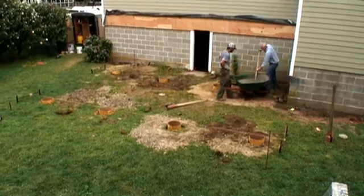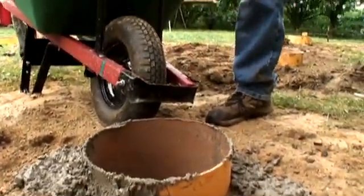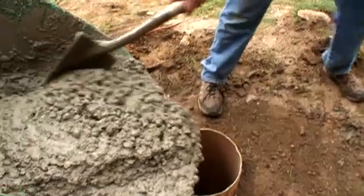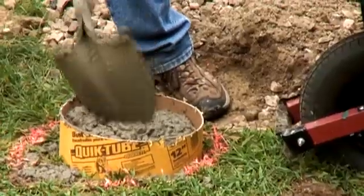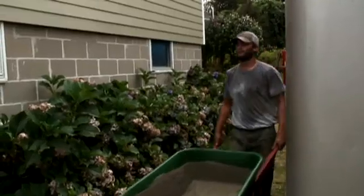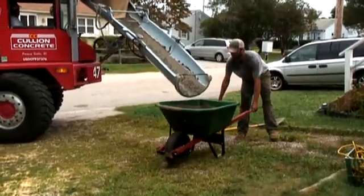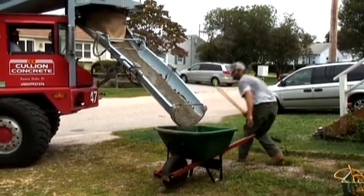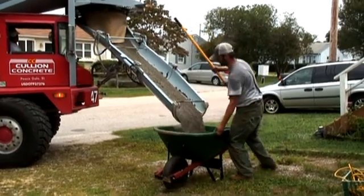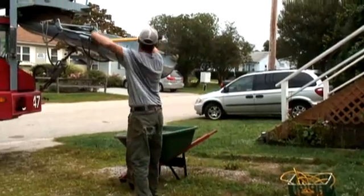But when the volume of the concrete needed approaches or exceeds 1 cubic yard, which is usually about a dozen piers, then I call a concrete company. Most concrete companies have a 3 to 4 yard minimum. This means I get charged a minimum even though I might only order a yard or so. But I can usually get a break on that minimum charge by putting in the order first thing in the morning. That lets them come by when they have extra concrete left over from another job. There's plenty of other work that needs to get done before I need the footings anyway.